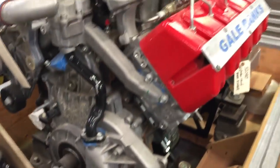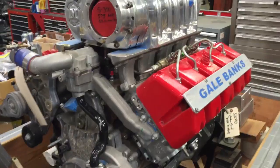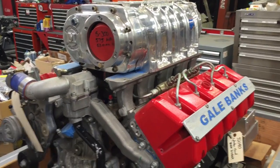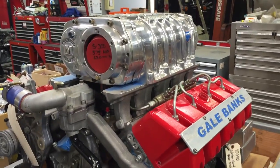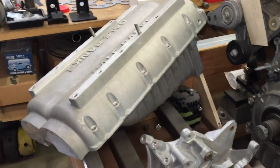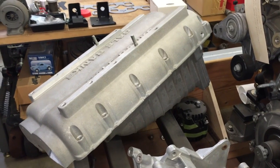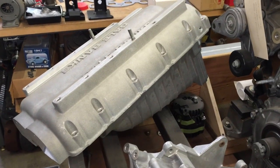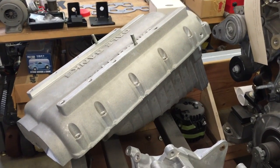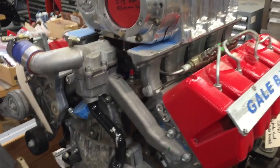Here's what I'm doing. Here's a marine mock-up that I'm doing with the Duramax. This one would be a 7 liter, 427 incher. Normally on top of these ram tubes that you see under this blower — which we're mocking up for another idea — it would be this casting over here. This casting sits on top of the ram tubes and has an intercooler core inside of it. Turbochargers or a blower blow into the back of it, up through the core and into the camelback top, and the air does a 180 into those ram tubes.